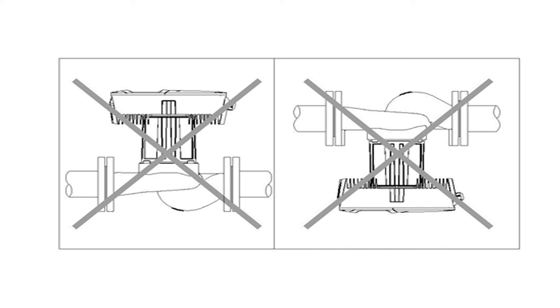Location of the control box can be changed upon request for screen view and ease of use of keys in horizontal assembly applications. For this, four screws connecting the pump body and motor body are removed, and the motor body is connected after rotating 90 degrees.